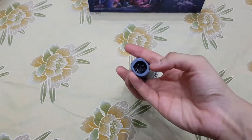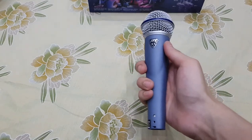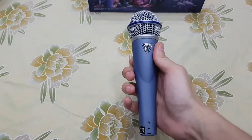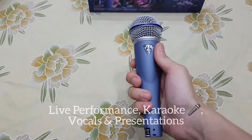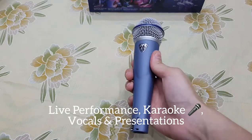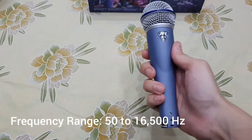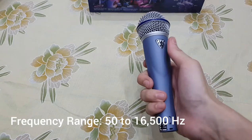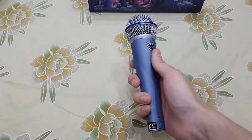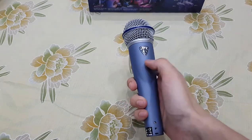Let's connect it with XLR. I'll tell you about the features. This is the best microphone for vocals. It can be used in live performances, presentations, karaoke, and vocals. The frequency range is 50 Hz to 16,500 Hz. It can be used in low distortion and low noise conditions. Most of the time when we hold the mic in the hand, the background noise is reduced.